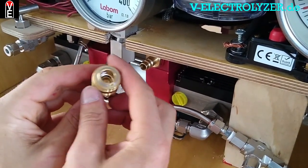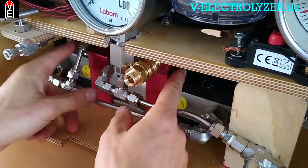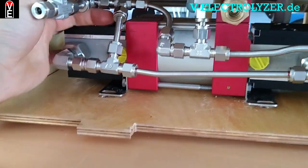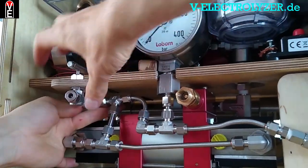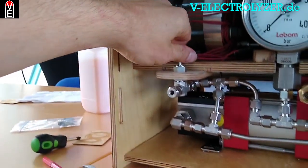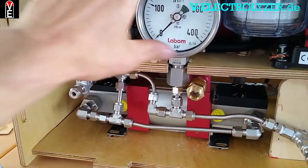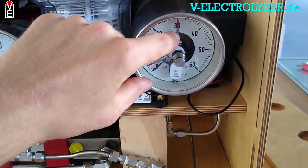The air compressor is connected and runs up to about nine bars. Now the compressor is on and slowly this booster — the thing at the bottom — will start its cycle and boost your hydrogen four times the initial pressure. If you open this valve your bundle could be 300 liters — more or less — and it will fill up to 120 bars. The cycle from 5 to 30 bars will repeat over and over until 120 bars is reached.